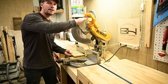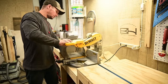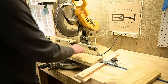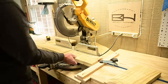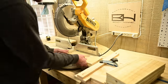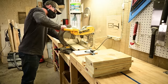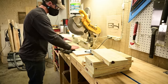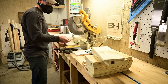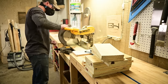With every fresh picket, always cut off that raw edge — just an eighth inch, it just gives you a much cleaner edge. Initially there are three cut lengths: one at 15 and a half inches, eight of them at 13 and a half, and seven of them at 11 and a half. For the continuous cuts I set a stop block to make quick and accurate work of cutting them.